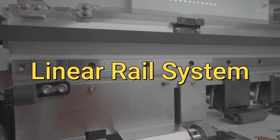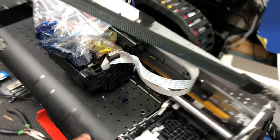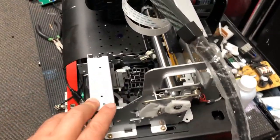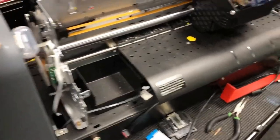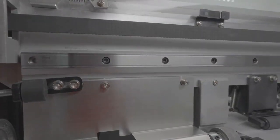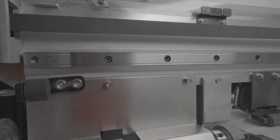When we talk about the linear rail, we have to compare it with a regular Epson printer. This $5,000 modified Epson has a rod rail, and because the printer carriage is a lot heavier than Epson's original ones — you put so much stuff on it — this part has a lot of stress and is easier to wear out. It is unavoidable that you're going to generate lots of heat and noise, the motor runs really hot during printing, and you might burn your motor out or wear your rod out. The Sublistar uses a linear rail, whose advantage is phenomenal accuracy and stability, which is critical for the speed you're going to get.